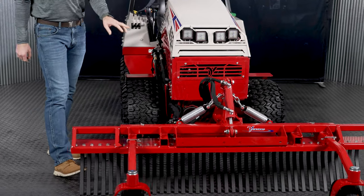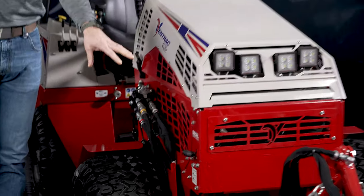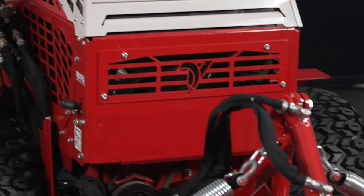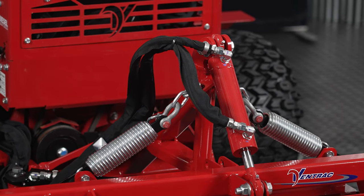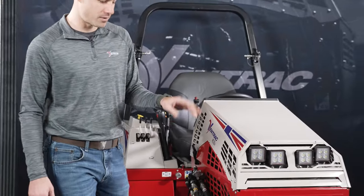We have the ability to do this in two separate ways as well. If your tractor has dual hydraulics like this unit, you can get this accessory kit. If your tractor only has a 12 volt, you can also do this with the opposite kit that runs that cylinder off a 12 volt switch so that you don't have to have the secondary hydraulic function. So no matter which tractor configuration you have, you can add a separate accessory kit to do that hydraulic function.